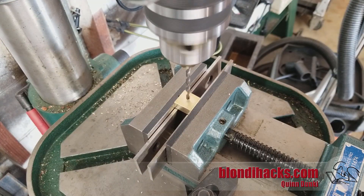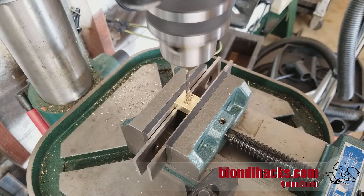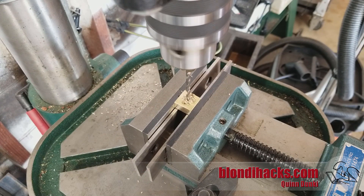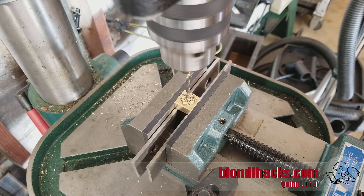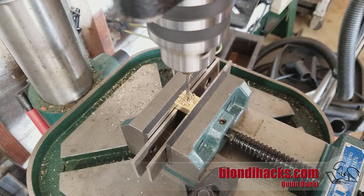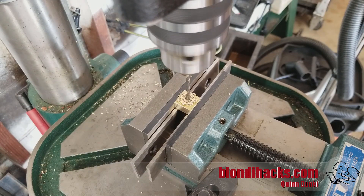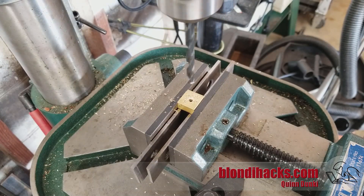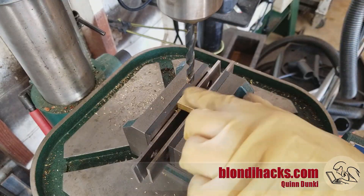The centers have been punched and we're going to drill through now for the mounting screws. This drill is turning frankly too slow for the size of the bit and for brass, but this drill press has one of those triple cone belt speed-changing systems and it's kind of a hassle. This is the fastest I can get with only changing one of the belts, so it'll do. Now we're going to countersink for the heads on the screws and I don't have a proper countersinking bit, so I'm just using a large drill bit here, which works quite well actually. Perfect countersink — it's always very satisfying.